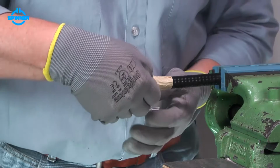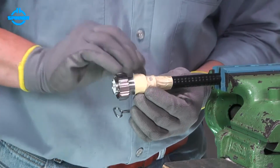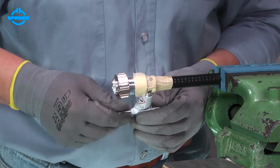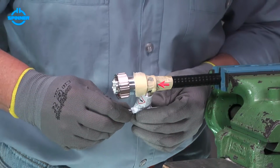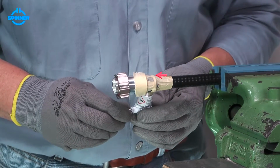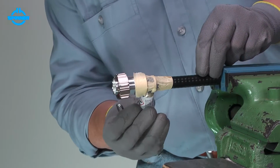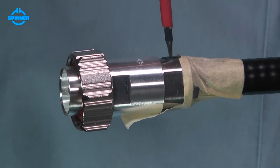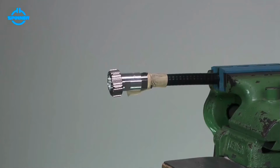Tape the vent hole and continue squeezing Plast2000 into the connector. When Plast2000 leaks all over the pierced tape, it has filled the inside space entirely and the connector is sealed. Remove Plast2000 tube and quickly screw the included plastic cap into the charging hole. Now the spinner cut and fit monoblock connector is installed.